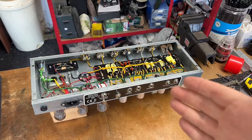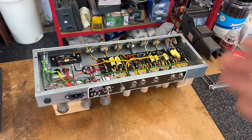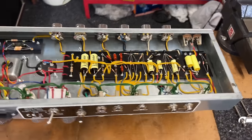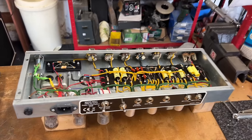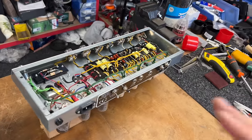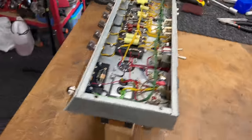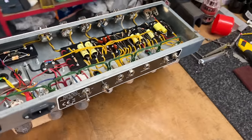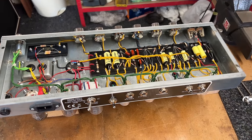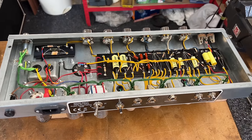Here's the black tolex'd, brown plate circuit PR18 that came in for black panel conversion — circuit only. That's now all done, all tested, and sorted. Just finished bench testing it — bang on where it needs to be, sounds great, looks great. The other thing was to tweak the reverb circuit so it's not as intense at the lower end of the dial, which I've now done. Customer can report back to confirm he's happy.